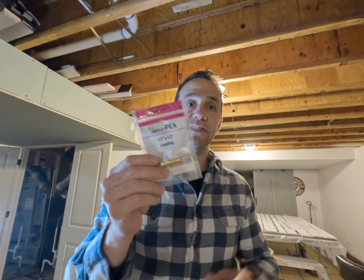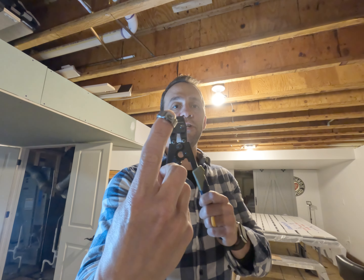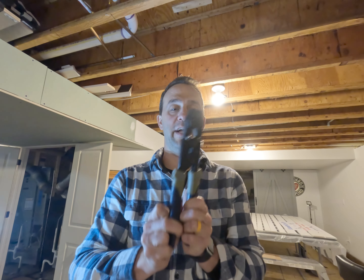But if you're going from copper to copper and you want to do PEX in between, then you're going to need two of these. In my case, I need a coupler — this will allow me to go from PEX to PEX. And we need pinch clamps; this is the system that I use. They use these pinch clamps, and I have this pinch clamp tool.